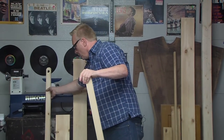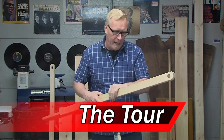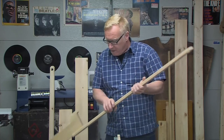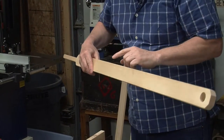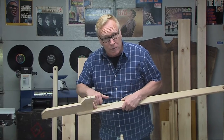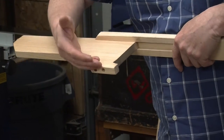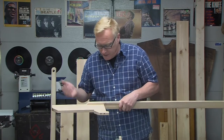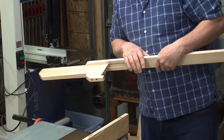Let's look at our first project — we're going to make a pair of kids' stilts. I'm using straight grain, clear white pine. If you're making these for an adult, you might want to use poplar and make the shaft longer. I've ripped these down to two inches and put a little chamfer on the edges for comfort. At the bottom I've cut a dado joint where I glue in the foot. I've attached a horn — an extra piece — so a child's foot doesn't slip off. First we'll rip our shaft pieces to width, then cut our foot pieces.